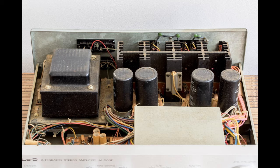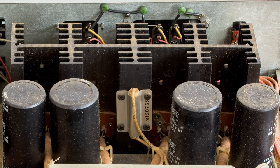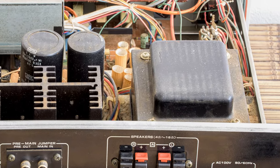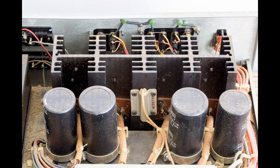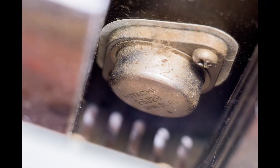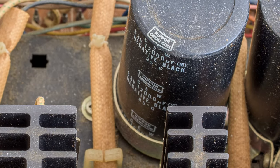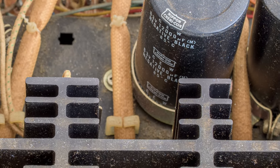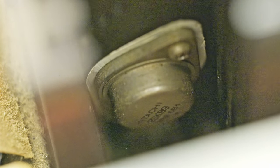It's bloody dirty — alright, disgusting — but I'm not gonna clean it up right now. The amp is not chock-a-block with electronics and heat sinks, it's rather empty. It weighs only about 26 pounds, which is about 12 kilos. The channels are not separated too well — it's got only one transformer for both channels, and it certainly doesn't scream top quality. These caps still look original, though that doesn't mean it's a good thing. Unlike transistors, electrolytic capacitor lifespan is limited — anything above 20 years is considered not good, though they can survive much longer. The 500F uses Hitachi's own transistors, used only in this particular model. If those transistors go, it's nearly impossible to fix the thing.